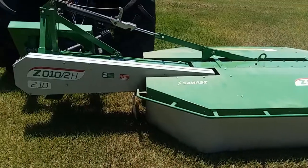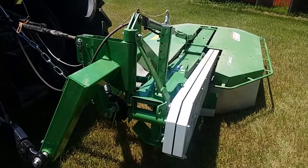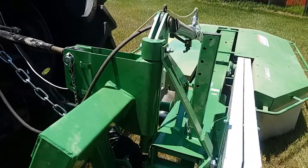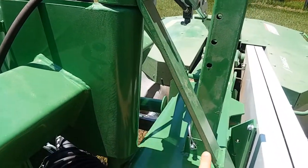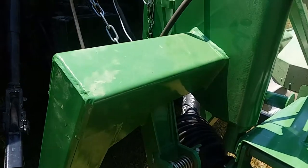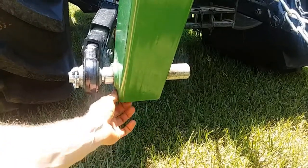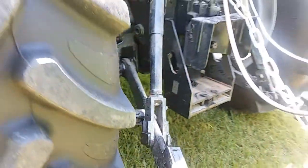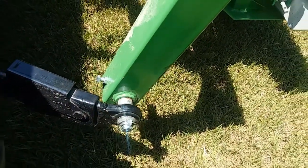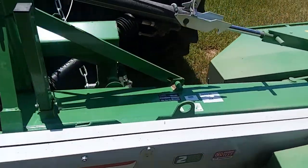One of the things you want to know if you're going to make an investment like this is the quality of what you're buying. One easy way to get an assessment on that is just look at how thick the steel is. You'll notice on this crossbar right here — that's a pretty thick piece of steel. The frame tubing here is of equal thickness, and you can feel it's all the same thickness throughout. The lift arms have some nice conveniences too; if you need to adjust those pins in and out you can easily do that through this bolt, with several slots allowing you to adjust in and out.